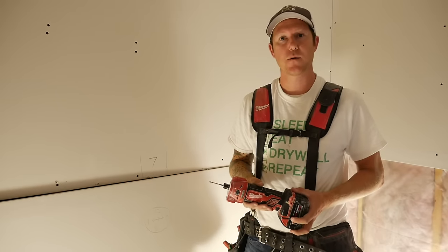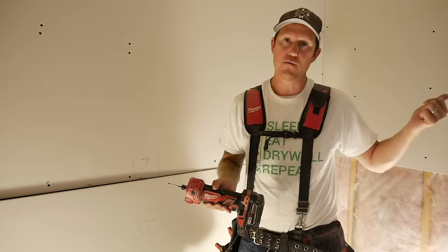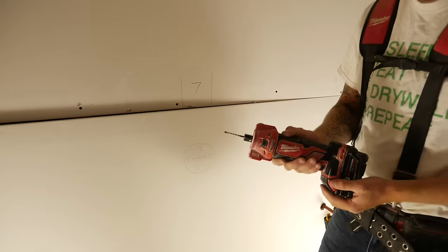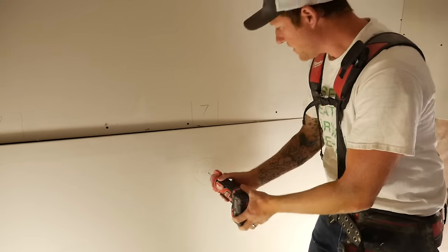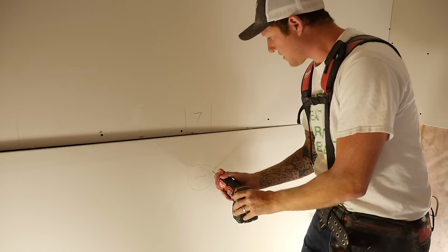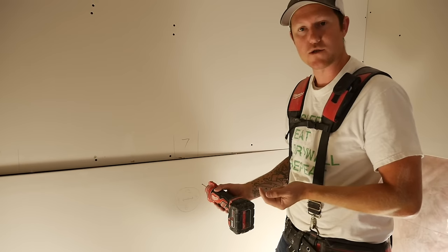So the last thing I want to talk about in this video is the direction of cutting. There is a right and a wrong way of cutting around plugs and in windows and door frames. So if you're cutting on the outside of something, because of the direction the blade spins on the router, I've drawn a clock here, you go counterclockwise. So for this one, I would poke in, and just personal preference, I always go to the right. I find the edge of the box and then poke in and then go around counterclockwise. It'll just hug the box, it won't dig in, and it makes it so you won't screw up.